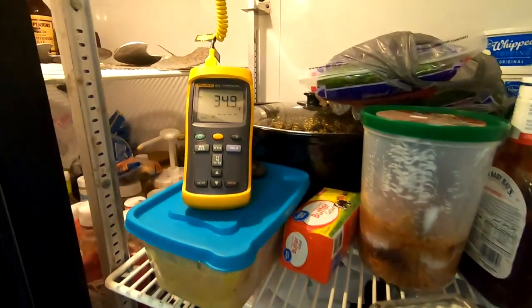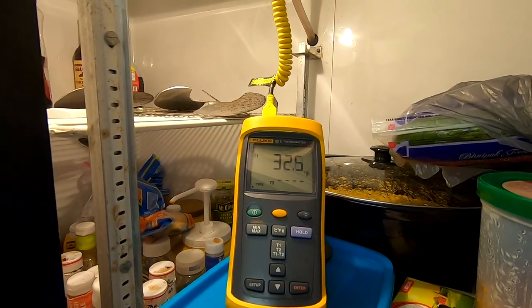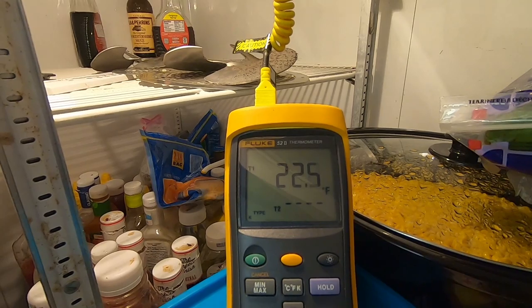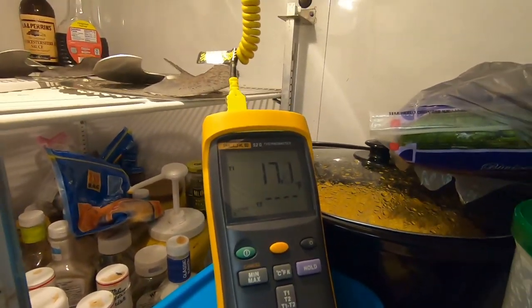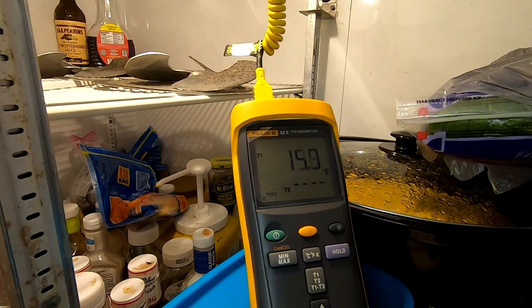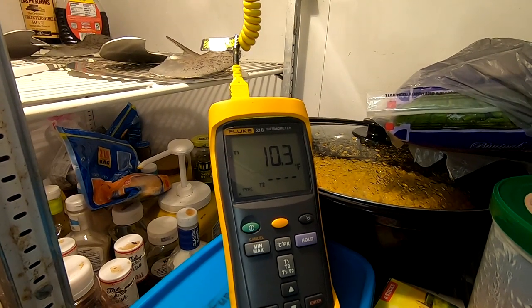So before I go tapping into it and disturbing the refrigerant charge, I'd like to see whether it's that or a thermostat issue. If we get really low down in there and it just doesn't shut off... look at that, right off at 15. Gotta love it when things work correctly when you get there. I'm gonna say the thermostat's probably our issue.